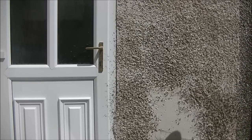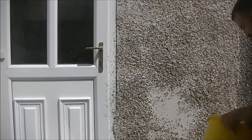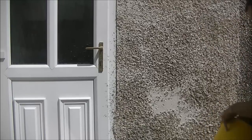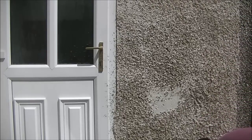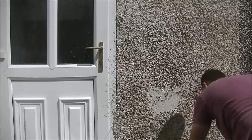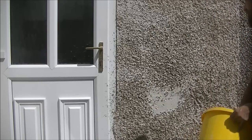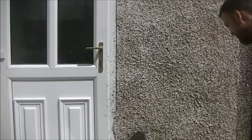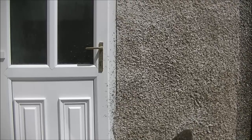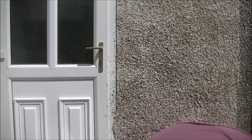In my mix as well, I actually put a wee drop of SBR and waterproofers. For a color coat system, you shouldn't use mortar mix. Although for this, because this is older, I'd put a splash in. I'm not too concerned about it staining, as you can see my stones are quite dirty. I've put a wee tiny bit of sand through my stones just to dirty them up a bit and help dirty the background slightly. Although the clip at the start is the day after and the sun bouncing off it, you can tell it's a fresher coat.